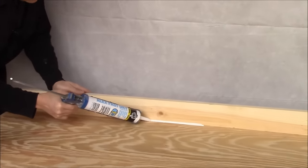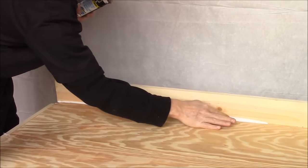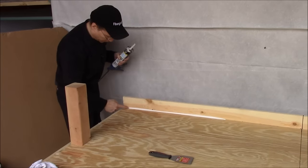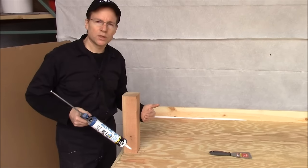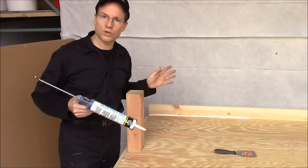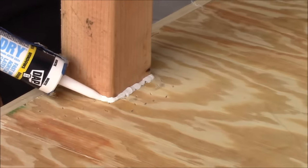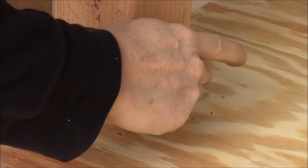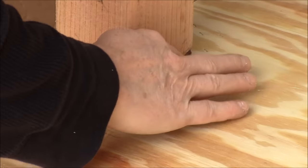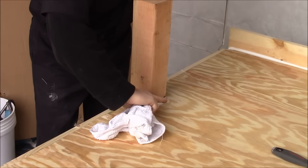Here's how you do it — put one nice clean bead and smooth it out with your finger. If you're not going to fiberglass up the wall, use clear caulk. You need to caulk around the post. If you're going to fiberglass up the post you can use any type of caulk, but if you're just going to fiberglass up to the post the way we recommend, use clear caulk. I'm using white caulk so you can see what I'm doing. Put a nice heavy bead of caulk all the way around the post, smooth it with your finger, and you get a good seal. Then fiberglass right up to that.